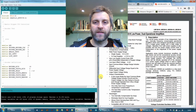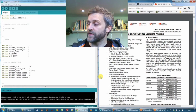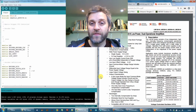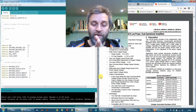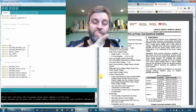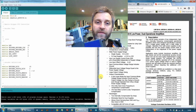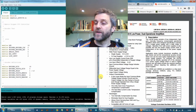Okay, so now we need to convert that DAC output of 0 to 5 volts into the current loop type signal, which is 4 to 20 milliamps, which is what this valve currently uses. So the 4 to 20 milliamp signal basically is very good because it's good for noise immunity, and effectively 12 milliamps is where the valve is in the middle of its travel, 20 milliamps it's at one end of its travel, and 4 milliamps it's at the other end of its travel. And the range from 0 to 4 milliamps is basically an invalid signal, and with this particular valve it will shuttle back into a fourth position, which is like all ports blocked as a safety feature.